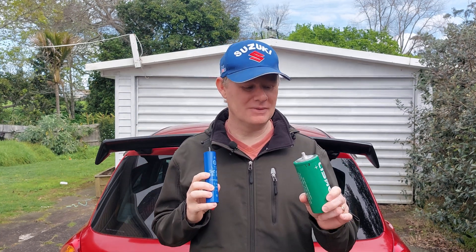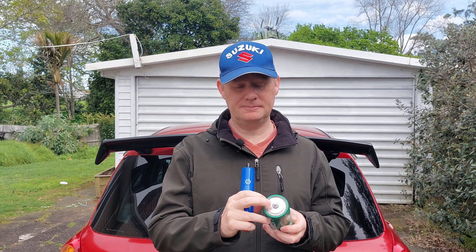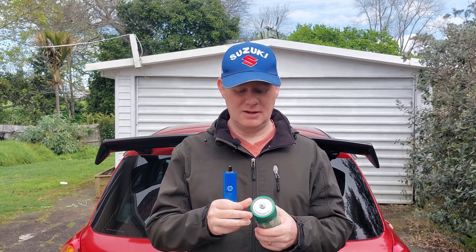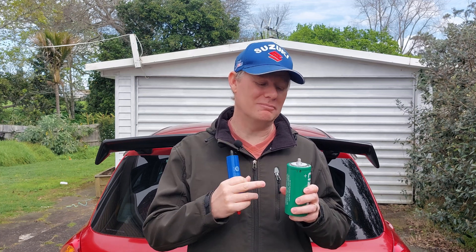You can get scammed if you never receive them. The 18 amp hour ones — the ads said they were brand new, but I got some of them and they are definitely not brand new. I know they're not brand new because of the damage to each end of the cells. This is actually a pretty good one, and they've all got different serial numbers, which seems pretty strange — completely different letters. Obviously we can test the capacity, and they actually tested pretty good capacity wise. That's because LTOs have such an incredibly long life that even after 10,000 usages you're still getting a really good capacity. But the main reason why I know they are used — other than the fact that they're damaged and they're actually old cells — is the fact that their internal resistances vary quite a lot.